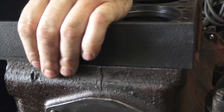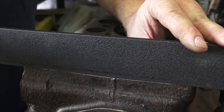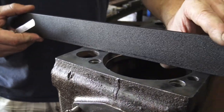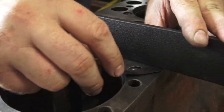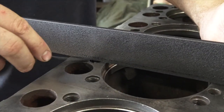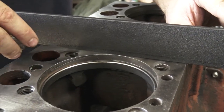After you do the crosses and everything, you need to go from here back and several different places. Generally on your cylinders, you're going to split your cylinders in half — put your straight edge right there. It can be hard because the pump is in the way, but you can kind of feel it if you put your hand down where it's flat. Split your cylinder in half then check it, going right between them. If you're able to fit a feeler gauge, the tolerance is like three thousandths of an inch. Take a paint marker and mark where it's low.